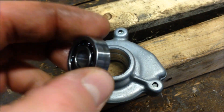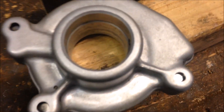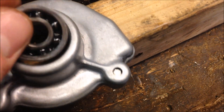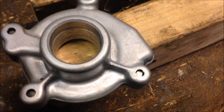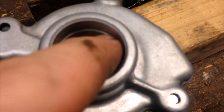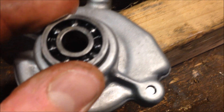I've got the old bearing cleaned out, put oil in it, and it spins real nice and smooth. We want to start with that — it doesn't matter what direction it goes in, but it'll go in like that. You can see there's a little inner lip, so we want to seat that down all the way. Set that there and tap on it with a hammer.